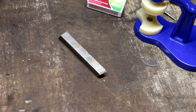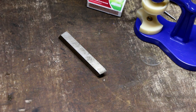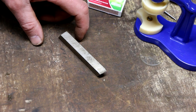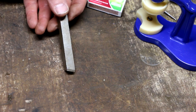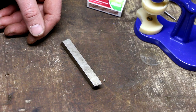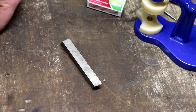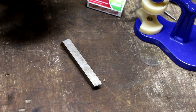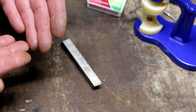So in order for me to put the stump jumper and assembly back onto the bush hog, I need a key to go on the shaft. And the key that it calls for, according to the parts manual, is 7/16 by 1 inch. And I just checked that groove, and it looks like that's what it calls for. It's gonna be loose because the grooves are damaged.